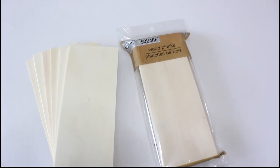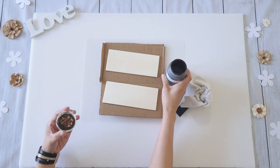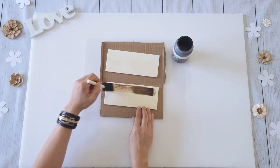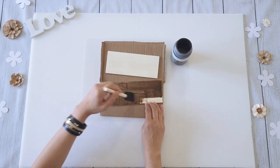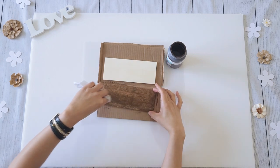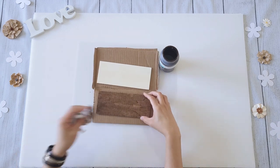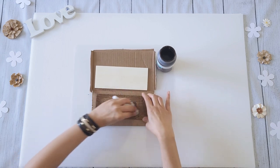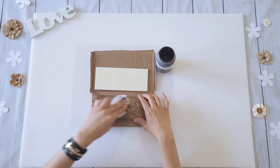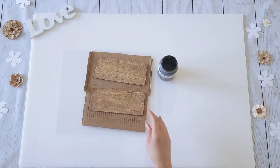To start off, you're going to need two 7-inch wooden planks. I purchased these at Dollar Tree and they came in a pack of 6. I'm going to add some color to the raw wood with Waverly Wax — I take a brush and apply that everywhere. Once I get that on all sides of one plank, I immediately take a damp rag and buff it out while removing any excess resting on top. I really don't want the wood to be too dark, so I do spend a little more time wiping off the wax until I get the desired shade I'm going for. Then I work on the second plank and wipe and buff off the excess as well. I love how the wood grains and patterns just pop.